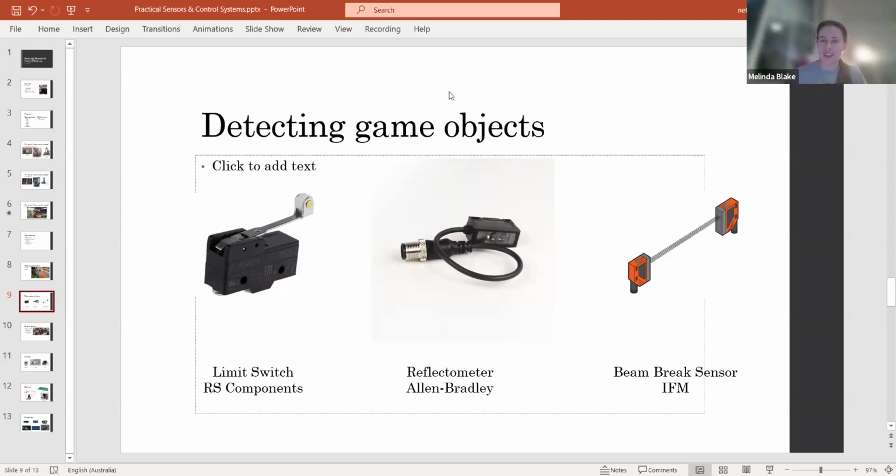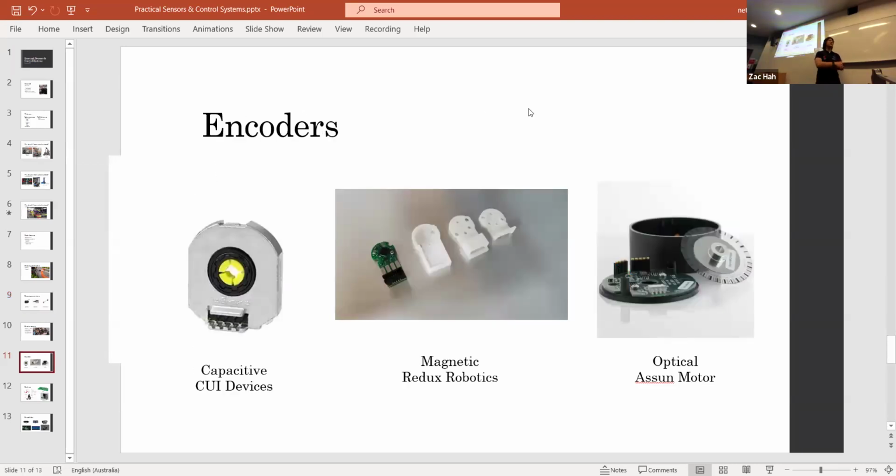I've got another one, and I think this will be applicable to a lot of teams. We build a lot of arms. Do you have a particular rotation sensor that you would recommend that teams use for arm positioning, like arm angle? I try not to play favorites. Of course, I have ones that I'm particularly drawn to. So the REV Through Bore Encoder, the half-inch hex Through Bore Encoder, was really easy to use when we used it on the Quokka robot.